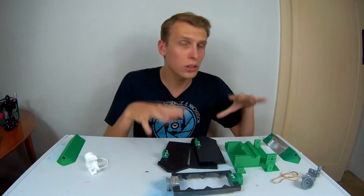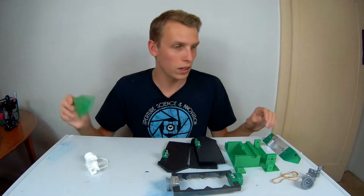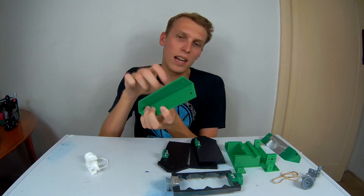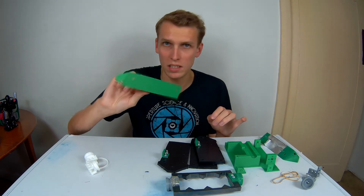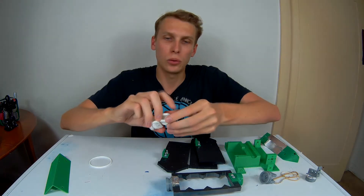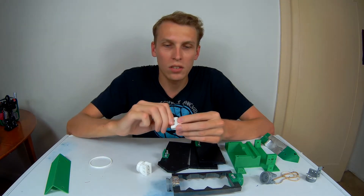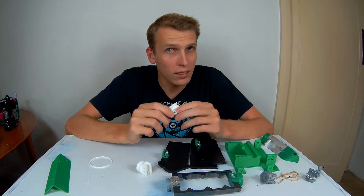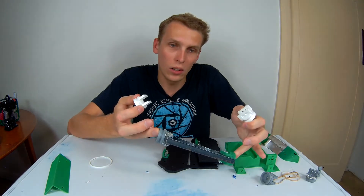So right now we're going to redo this whole build and make some fixes and changes. One of the big things is I've changed my ablative armor from about six mil down to about three mil, so these are going to sit out on the sides and take the hits for me. I might still add some aluminium to them to make them last a bit longer, and I'm planning on printing a bunch of these to take with me. We're also going to upgrade from ABS or PLA to TPU. TPU is one of my favorite materials to print with — it's flexible and ridiculously strong when you flex it, and I'm hoping it's going to solve those issues.